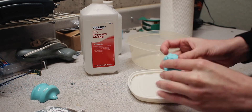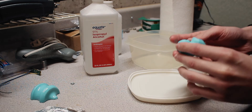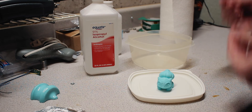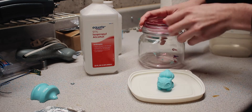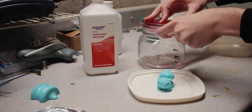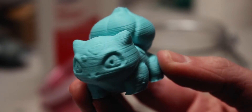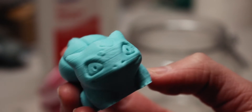I've gone ahead and printed out another model — a Tremander model — to see what smooth level we can get on this. For this model I'm going to try a different container because I think my previous container was not sealing all the way; when I checked it after a couple hours the paper towels had dried out. So instead I'm going to use this glass jar with a really nice tight sealable lid, which should keep the solvent from evaporating much better. I also printed this model at 0.16mm layer height instead of 0.24mm, so it already has a smoother finish, and hopefully the final product will be even better than our first test model.